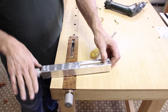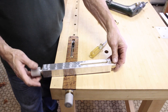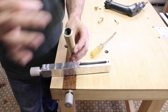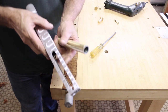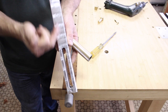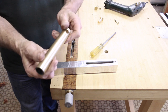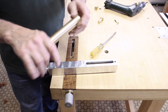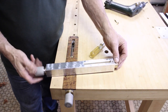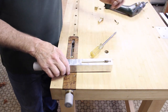If you need to clean the vise out, take it out of its position, wind that, and the brass tube just simply comes out the end. And you can see it's all greased up, so you don't need to do any greasing. If there was any dirt and dust in there, just blow it out that way. Don't blow it back into the thread. All right, just clean any build up of dirt there. A dry lube on the outside doesn't hurt, and that just simply goes back in, wind back the other way, and your vise is functional again. So very simple to look after.